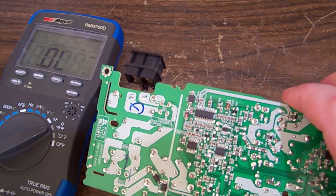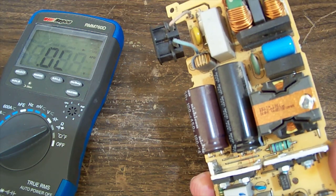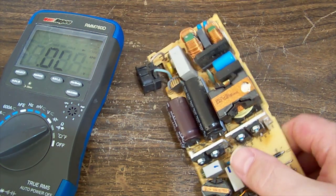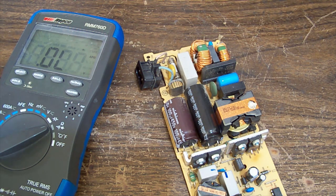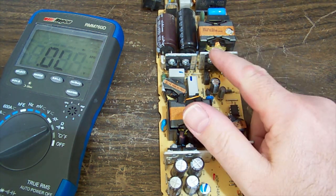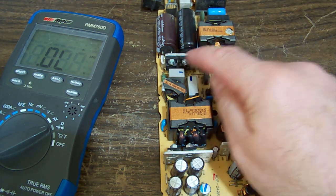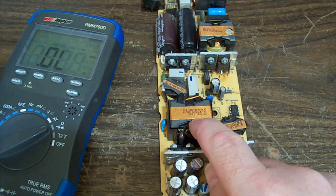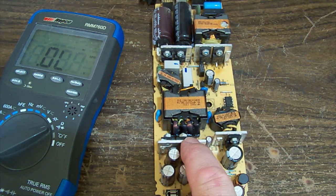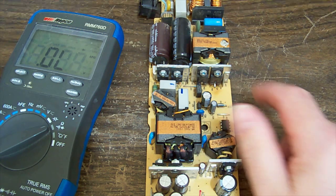Cool, okay. What sort of resistance have we got on the main filter cap? And I'd be curious about that inductor down in there too, that green one, if that's happy or not. But yeah, as I said, be careful of touching that plate. So this is the heat sink that was open through the back of the case there. That is actually the primary side, as is that one. So it looks like there's a couple of things going on here. But these heat sinks are the output rectifiers and our output capacitors. So yeah, don't always assume that they're safe.